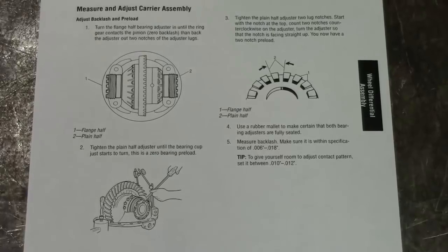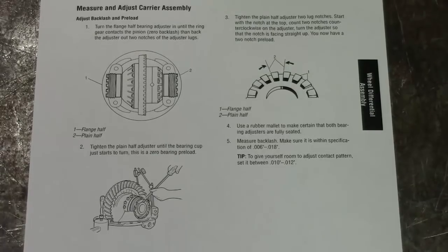These are two of the four major steps in reassembling a differential. The steps in order are: pinion bearing preload, pinion depth, side bearing preload, and backlash while maintaining side bearing preload. As you can see on this page from the Service Manual, there are only five steps in this process, and they will get us our side bearing preload and the amount of backlash we need.